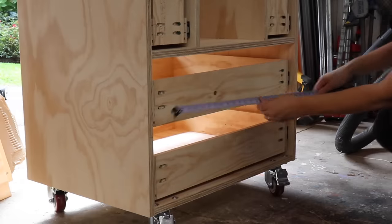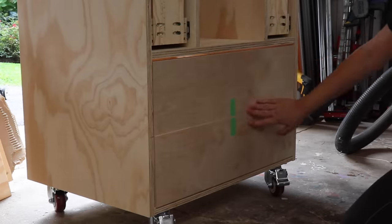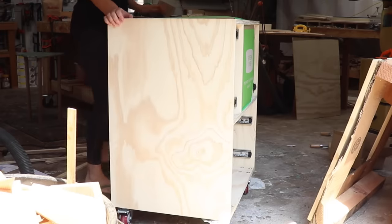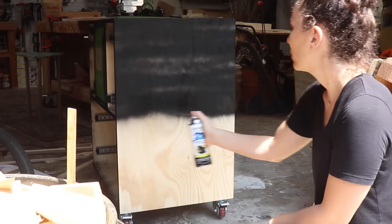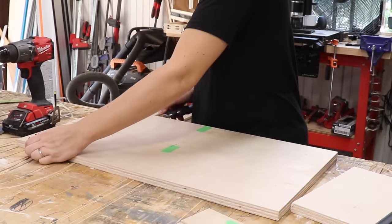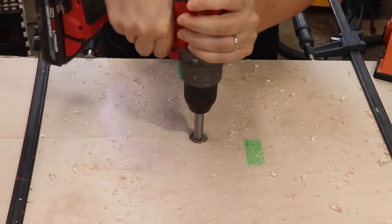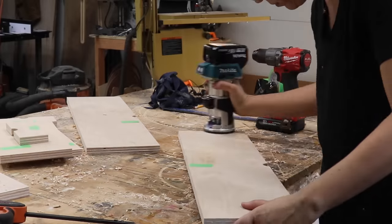All the drawer fronts need to be cut to size. I measure the opening and subtract a quarter inch because I'm aiming for an eighth inch reveal around all sides — an eighth on two sides equals a quarter. Since this plywood was kind of ugly I decided to paint it black. I considered doing edge banding but it's shop furniture. The drawer fronts are nice Baltic birch though. I decided an integrated handle would cause less hangups on clothing than hardware that sticks out. I started by simply drilling a hole between two of the pieces to make semicircles, but I'm going to change that for the bottom drawers — it felt too small.